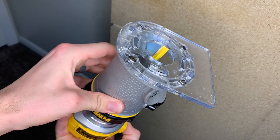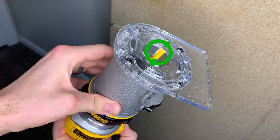On second thought, I brought us back inside because all I have to cut this thing with is a router. That's not the most ideal tool, but given that we're using particle board, having it cut in a circle through it — instead of cutting up and down like a saw blade — will leave less tear-out and make it look a little better. Plus that thing makes a ton of sawdust and I don't want to go out front because my wife will not be happy. Let's get it done.